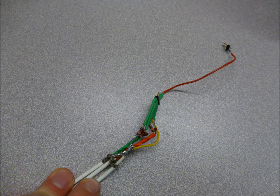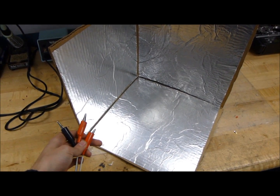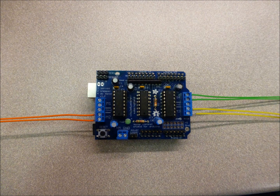Here is an example of how you can solder together all the resistors. Once you have your wiring harness made, take the alligator clips and clip them to each individual plate — usually down by the edges. Next, connect all the motors to ports M2, M3, and M4 of the Adafruit motor shield, then connect all the pins shown in the diagram to the Arduino through the motor shield as well. Once everything is connected properly, load the Arduino program found in the description below. Once the program is running, you can monitor whether it's working by monitoring the serial port found in the Arduino IDE. You should see the values change as your hand moves across the plates.